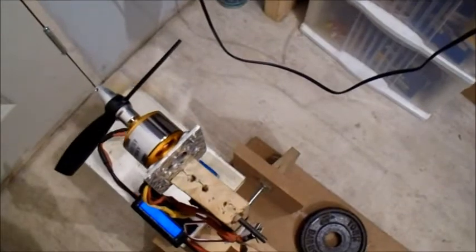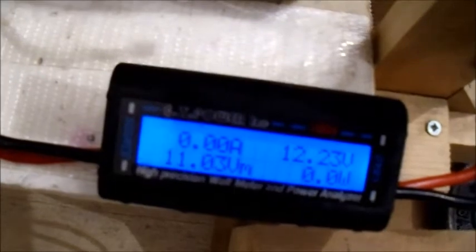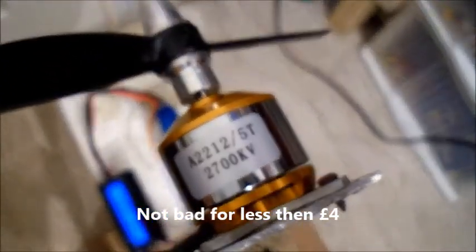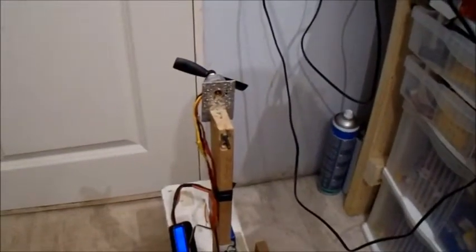So I think the TGS 4.5x4.5 performed the best, and yeah, I'd say you can get away with pushing one of those to 30 amps — about 100 watts more than it's supposed to take. For 4 pounds — what's that, about 5 and a half dollars? That's alright. I think I'll leave it there with that one.